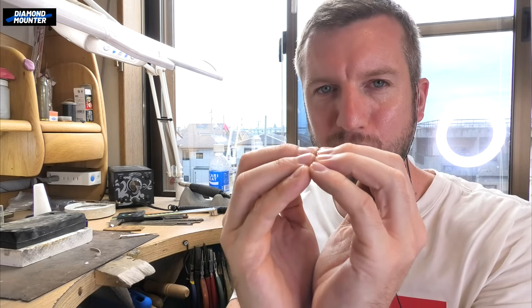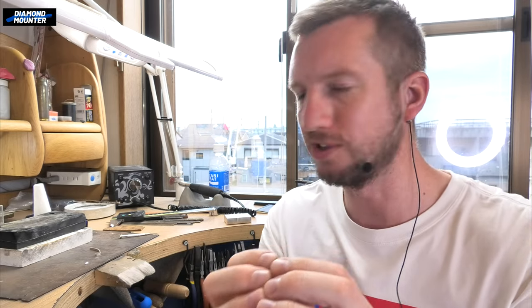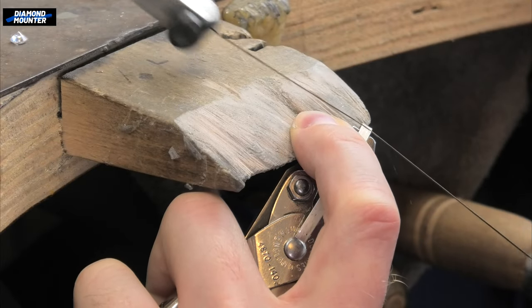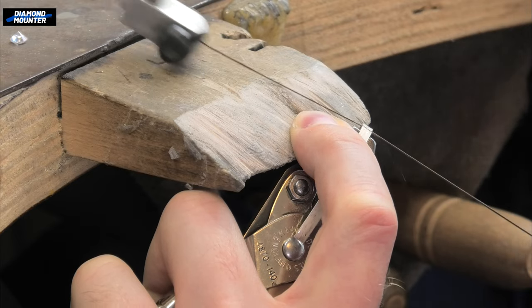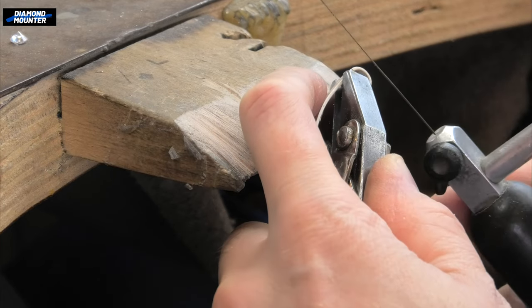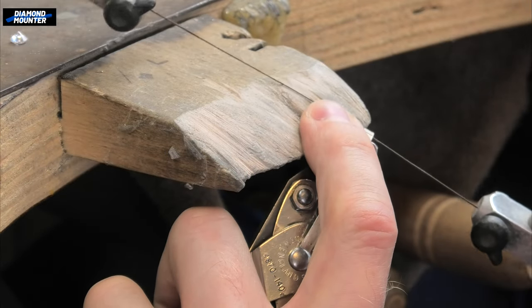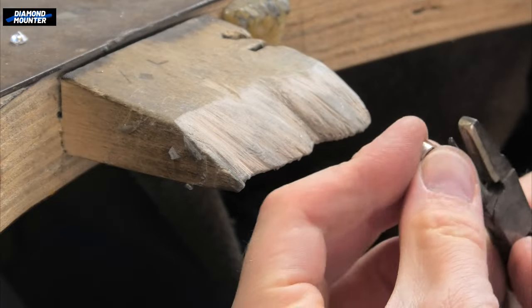Choose carefully where and how you cut it — you don't want it too small, so cut it a little bit too big on purpose. Then you can close it up and put your saw blade through the join, which closes it a little bit, reduces the size, and makes the join really tight and nice. Also, be careful to cut straight down — if you cut at an angle you'll have to file the ends back, risking making it too small. If you're worried about the blade jumping through and hitting the bottom of the collet, you can put your saw blade on the inside and cut outward.